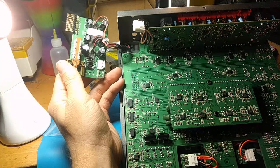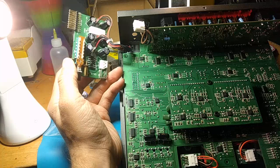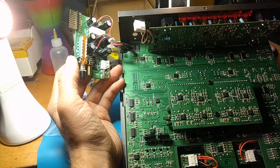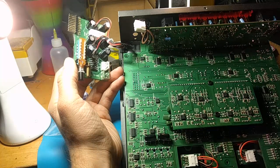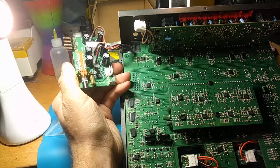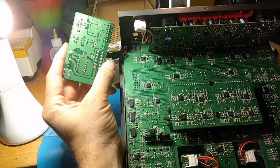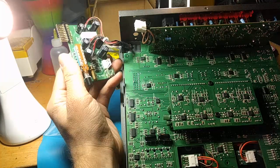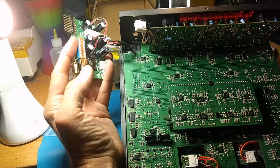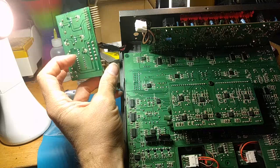It's actually around 18.3, something like that, without a load. AC voltages change when you apply a load. And there's no capacitor inside the power supply itself, so it relies on these capacitors in here. You'll notice there's really no fuse anywhere. Not a fan of that. You should always have fuses. And so that had me quite worried. You'll notice it also relies on this very large toggle switch, which is toggling all these different contacts at once.